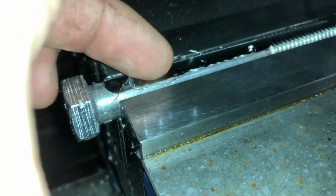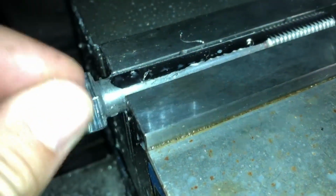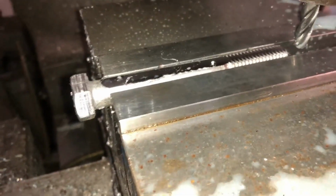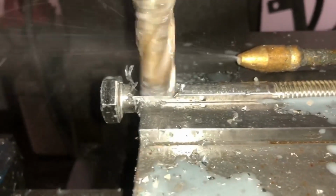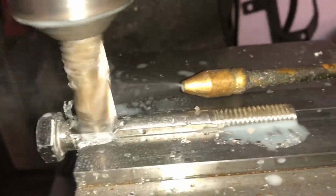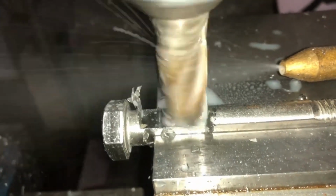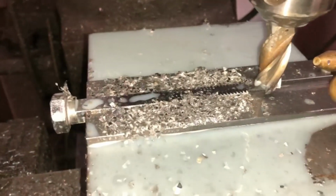this width and make sure it's a full 5/16. If not, I'll go a little down and across a little bit more. And after that, we'll cock it 90 and grab it there, and then mill off our third side. And just like that, I'm all done with 4 sides.